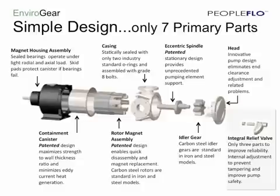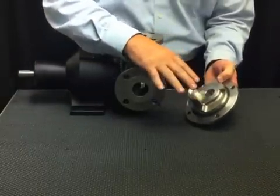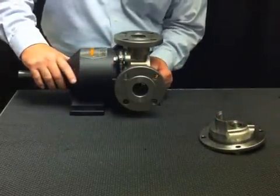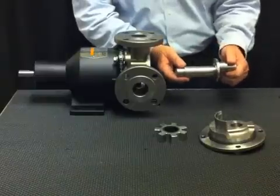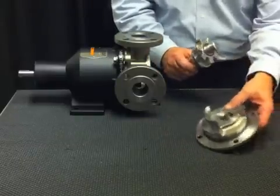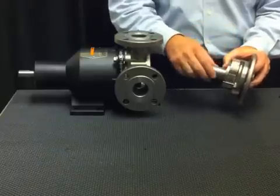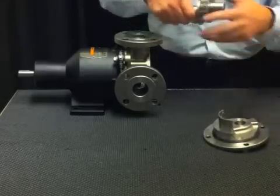Let me illustrate the Envirogear better by showing you the actual pump. I would like to start by removing the head from the pump. One of the first things to point out is that in the head you see a crescent, which is true of all internal gear pumps, but you do not see an idler pin pressed into it, so you start to notice some difference in the technology right away. Next pieces to remove are the idler gear and the eccentric spindle. This is the patented stationary eccentric spindle — the key feature of the between-the-bearing support system. This spindle allows us to remove the overhung load or cantilevered load from the pump. The idler gear mounts on the spindle, which is now supported in the head and at the crescent area. When brought together, the idler gear is free to rotate on that spindle, and as hydraulic forces develop, it is supported on two sides rather than just one.